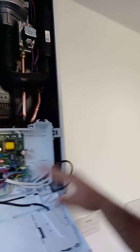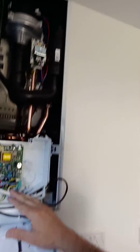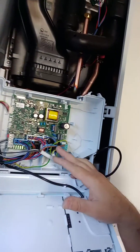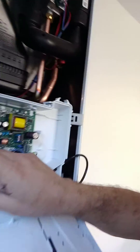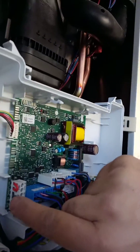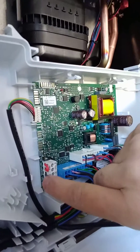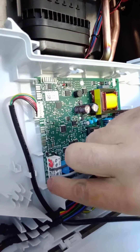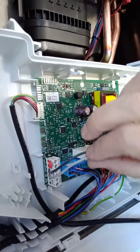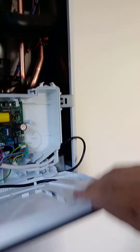As you saw, how I wired the top receiver — this is how it goes to the boiler. Live and neutral are here, and then we have got the PCB. You can see the 24-volt connection — the top one is the black wire which goes to terminal number one, and then RT, which is the room thermostat, is the grey wire on the bottom.